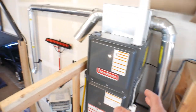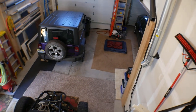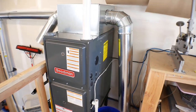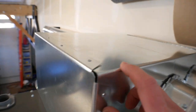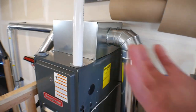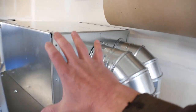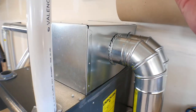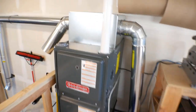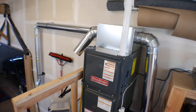This is an 80,000 BTU furnace, so it's probably pushing out around 1,600 CFM with four takeoffs — theoretically 400 CFM each through a five-inch round pipe, which means a lot of velocity. I did that on purpose because I want the air flying out of there so I can point and direct it. You wouldn't want that on a residential setup, but for this application it works well. I also have some leakage in the plenum up here, and the furnace itself radiates a lot of heat that seems to make a difference for the loft.